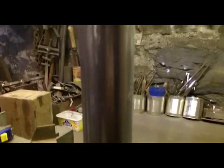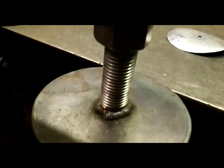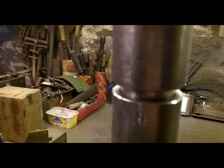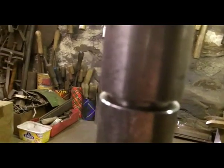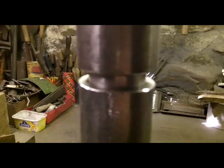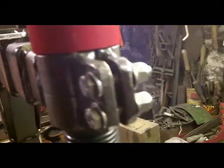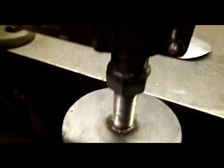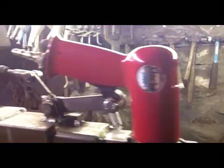As for adjustment in it, we've basically got a clamp here to hold the centre tube and there's a one inch threaded bar that runs up inside that. A large nut is welded to the bottom and this disc can turn - and when it turns you'll see the adjustment here as it lowers it. You can see that there and then it'll raise it. It makes a wee loud screeching noise but you can see the principle of it. I'll add some oil later on. Basically just a bit of tube cut with a couple of bits of flat bar and a couple of holes drilled and tapped, with three fixings to give it a nice firm grip.